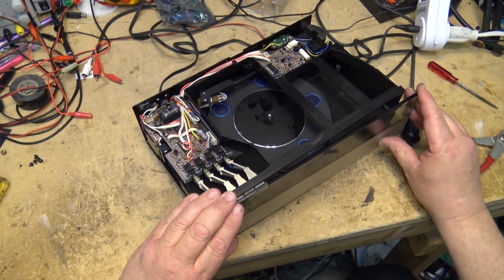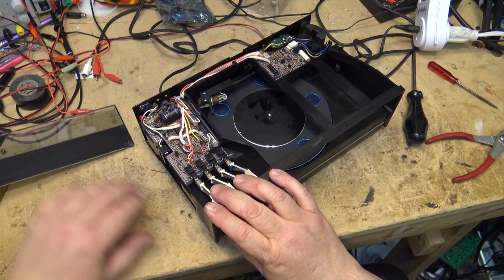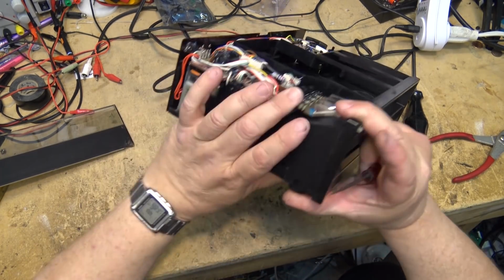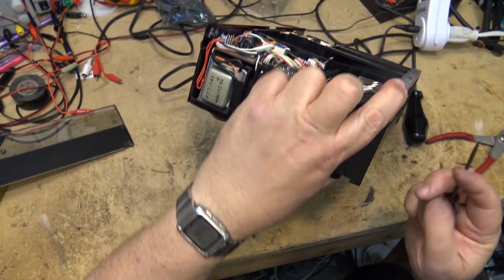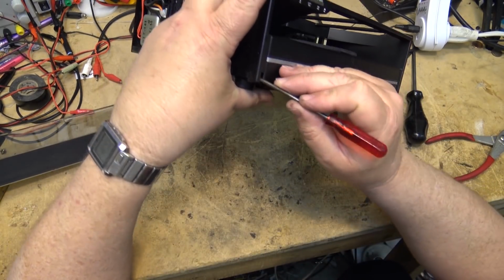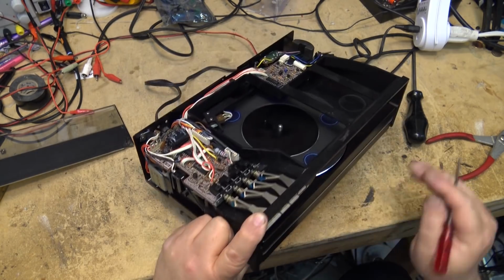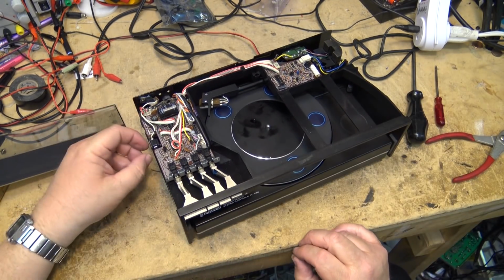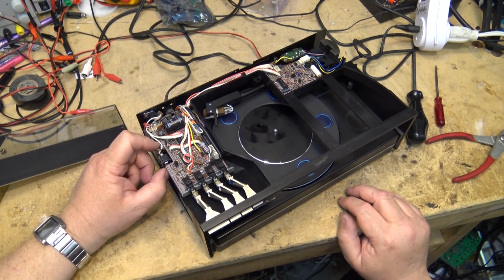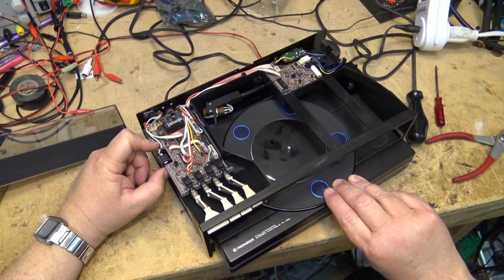Switches are completely covered. So when you pull this down, this little foot would push up on this lever down here. It would push up on this little lever here, which would in turn move this lever back. So there's the lever down here. Where is it? There's the lever here. And that would move that, like that. See? So when you pull the front cover open, that activates the switch. So now that turns on the power. This is basically your power switch for the unit. So that turns on the power when you open this up, and then the start-stop button would bring the turntable out.